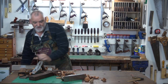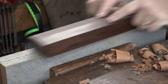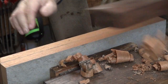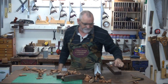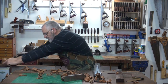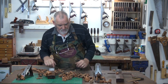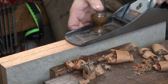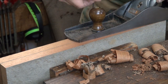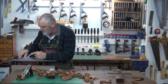Level them up, and then with the number seven — I'll use a wooden one but you could use a steel one just the same — just plane down and you'll get all that hit and miss. Overlap the strokes until you've got two really nice surfaces. If there's any damage or track marks in there, get a smoothing plane and just give it a couple of licks. Now we've got to put the sprung joint in. When you're planing, you plane normally, and then when you're about two inches or 50mm in — 70mm either side — push down hard on the toe. We actually get a nice thicker shaving coming out, then you release it at the end.